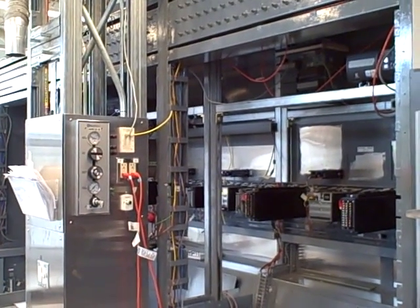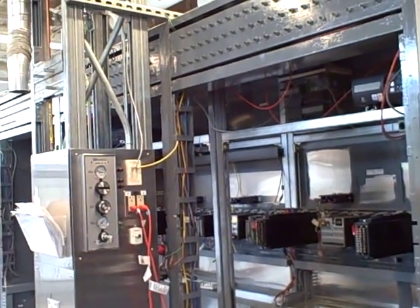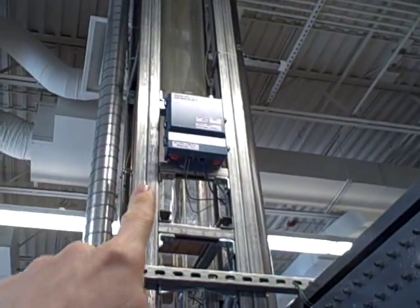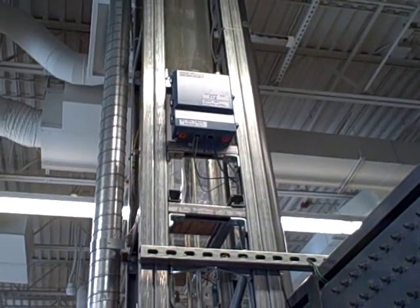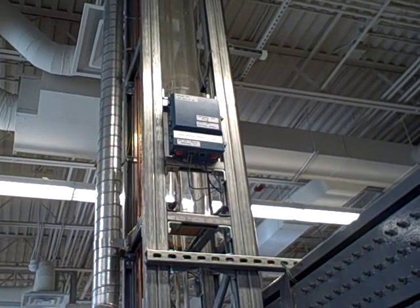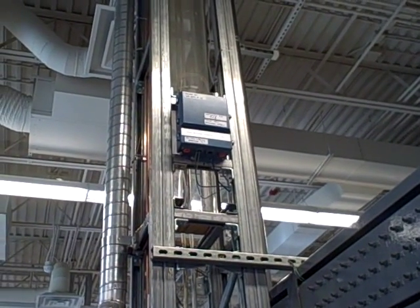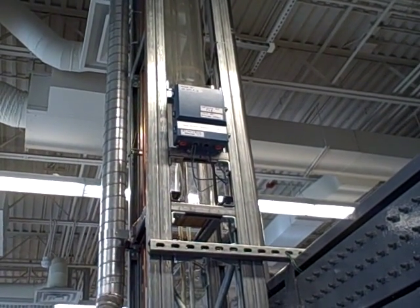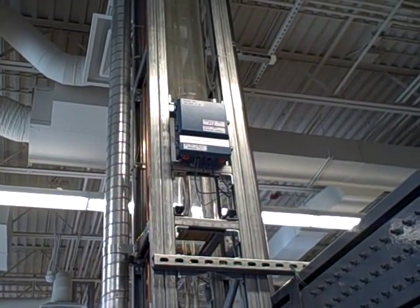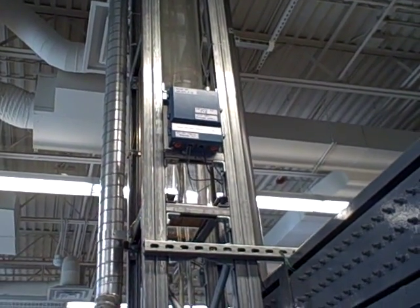In this video I'm going to demonstrate some of the features of the Emerson Smart Wireless Gateway using the WirelessHART radio network for field instrumentation. Right there up on that column, that blue box, is our recently installed Smart Wireless Gateway. It's a 2.4 GHz radio transceiver unit that acts as a manager for the wireless mesh network of field instruments. Outside our lab building we have a Rosemount vibrating fork level sensor and a Model 648 temperature transmitter measuring ambient air temperature, communicating to this gateway wirelessly over radio.